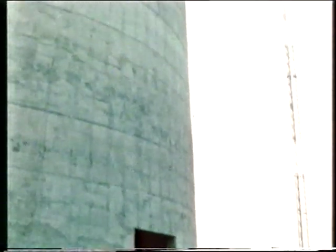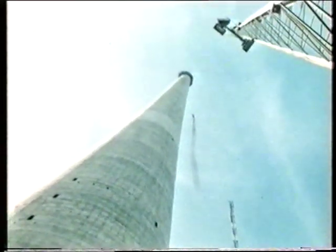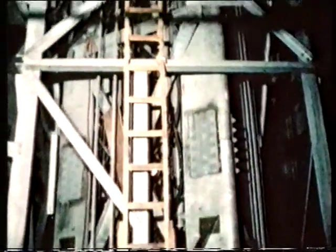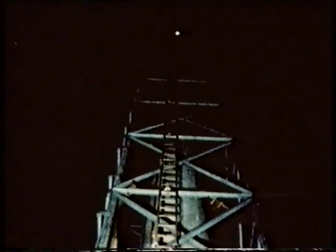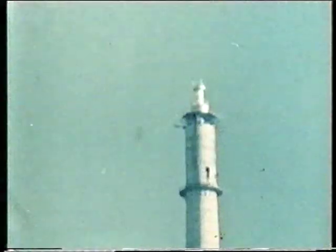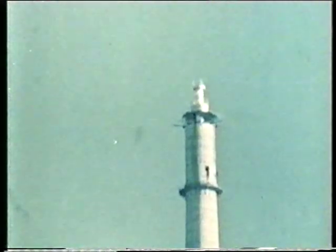Then haul the platform up and do it again and again and again, and in time it's 900 feet high. In the darkness of the base, a lattice structure was built for the aerials — 57 tons of steel girders bolted together to make a spike 180 feet high. Then lift it through the 900-foot tower. Decorate to taste with fibreglass panels to keep the weather out and the rigors in, and you're 1,100 feet above where you started.